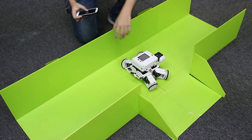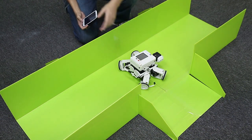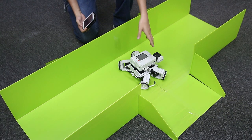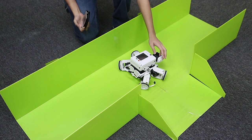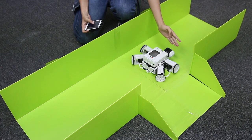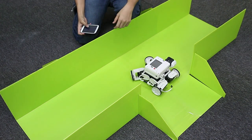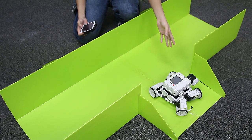So let's say your robot moves forward in a straight sprint all the way to the end. This robot is specially designed to complete this mission. I have a sensor loaded on the left side of the robot so that it can always search for the junction. Right now my sensor is sensing to the left so it can look for a junction. When it's here, you'll see there's a wall, so it will keep approaching forward. But once it goes out of range and it's no longer facing a wall, it can start to move to the left. So this is how you would complete your mission if you want to use a sensor.